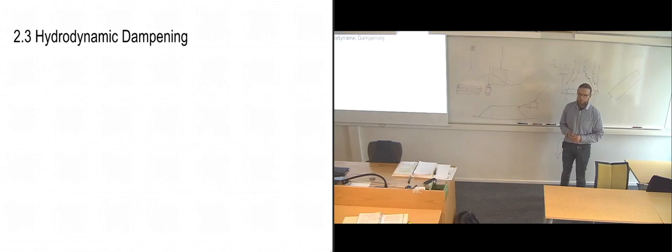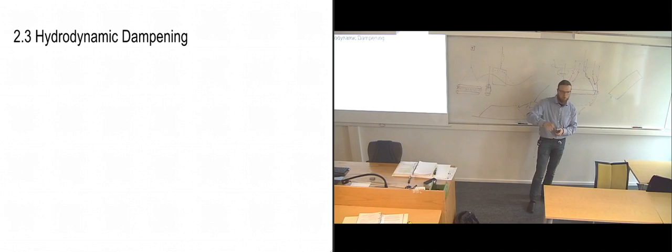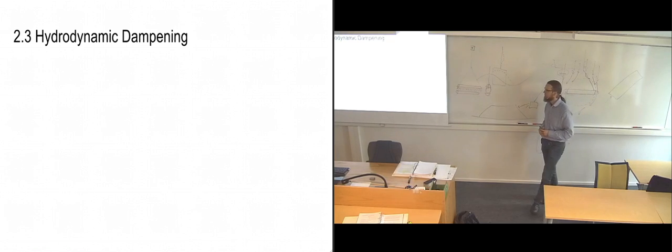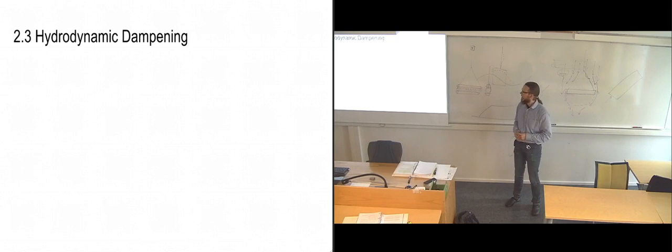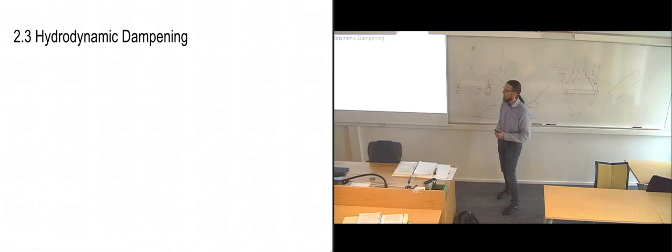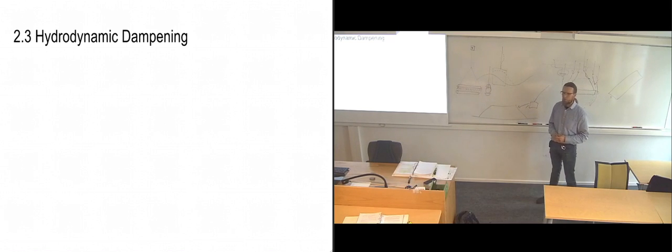One of the first calculations we did, well, we had the 3D model of the ROV, we put it into our system, and we started running the fluid particles inside the program. And then suddenly we got out, wow, that was a really low drag coefficient on this one. So we got like 0.06 or something in a drag coefficient, so 6%. That was really low. That was much better than we had thought.